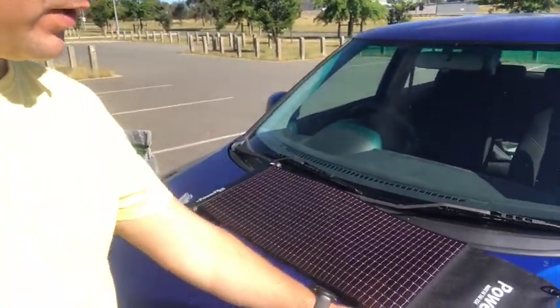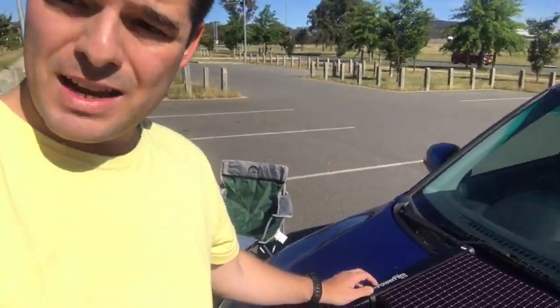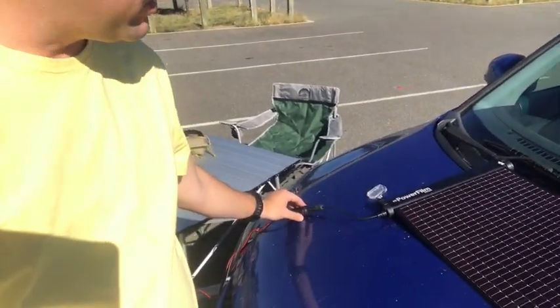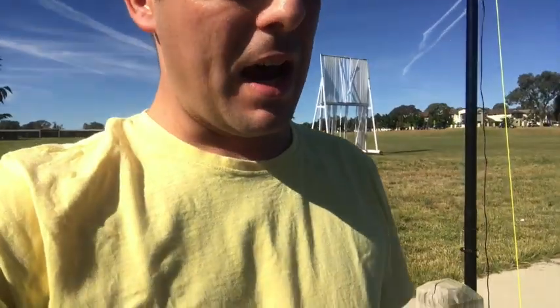It's the Powerfilm Max. I think it's about a 28-watt solar panel, but what it actually has is an 18,000 milliamp hour battery — or 18 amp hours. It comes with a supplied female cigarette socket, which I currently have attached to my radio directly, and it's been delivering about 12.2 volts. I wanted to test it in a real-world situation — how long will it run the 817, charging my phone and things like that. My goal is to be able to take this out and do multi-day activations with this as my primary source.